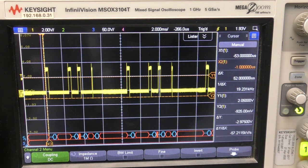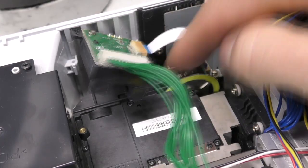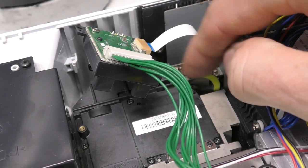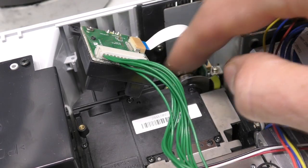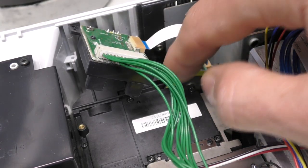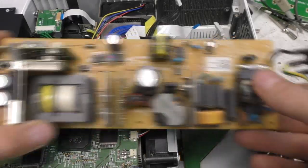There's a cycle of three — one, two, three — with different-length pulses, presumably one for each color. I'm also wondering if the reason for having a very long stretch of phosphor and a short gap for red and blue could be to do with heat — that amount of laser power hitting the phosphor is going to produce a fair amount of heat, so having the longer arc distributes the heat over a longer area of the wheel.